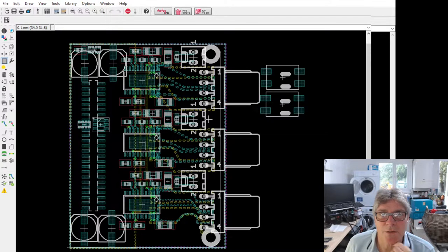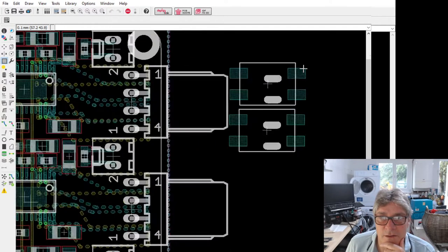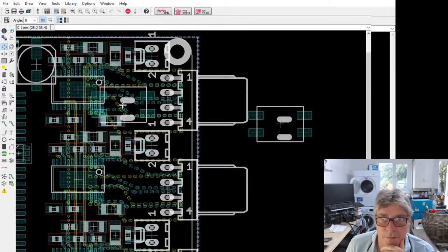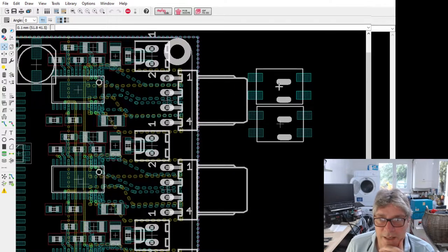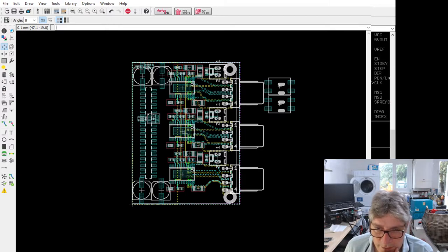So if I can get the surface mount ones on, I can populate them when I populate the other surface mount components. What those connectors look like are these. This is what they look like as a pattern. For each motor, I effectively need two of those, because there's four wires for driving a stepper motor. Four phases, two H bridges. So I will effectively need four of these.